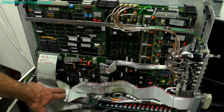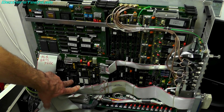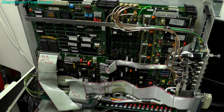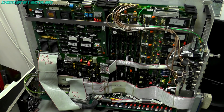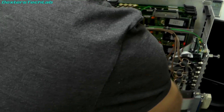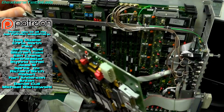The bridge processor is a completely separate 68000-based computer, so there's ROM, RAM, a real-time clock, and non-volatile RAM on there. Those will be battery backed and flat, so they'll need to be replaced - this board is going to come out and we're going to need to disconnect all these cables. The reason for all these big cables is they're all SCSI. The way the Quantel Paintbox talks to the bridge processor is over SCSI, and there are actually two SCSI channels - A and B - which is why we've got so many big 50-way connectors. So let's start by removing the bridge processor card.